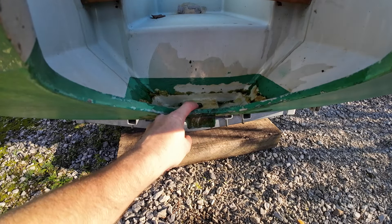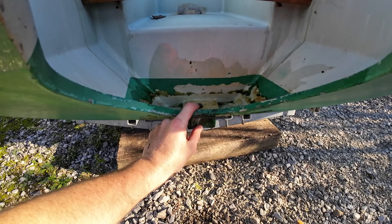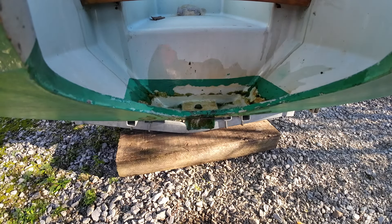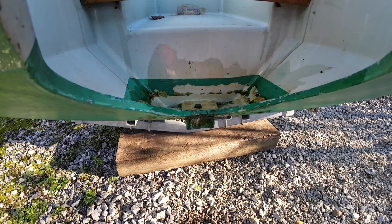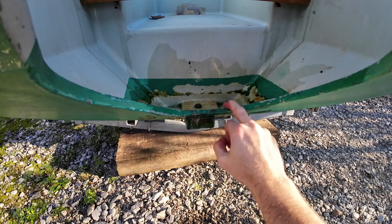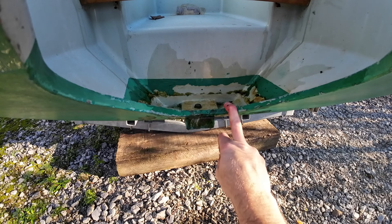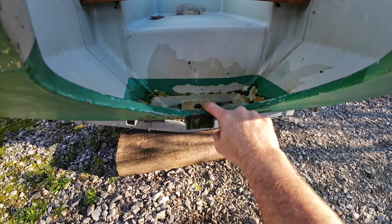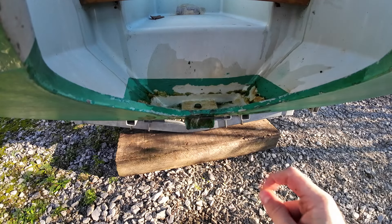There's a bolt we can't get undone, and I don't know why — maybe it's been locked tight for a reason. We need to chop that off and then measure those bolts so we know we can get stainless steel replacements for it. I think now is the best time to do it — we're right at the beginning of winter. If there are any problems, we may as well deal with them while the boat's not going in the water. So I'm going to attempt to get this off. These are bronze, it should cut quite easily. I'm going to try with my Dremel and also with my little multi-tool.